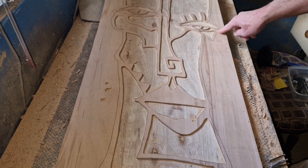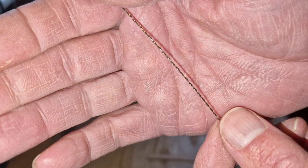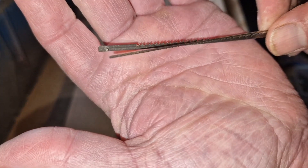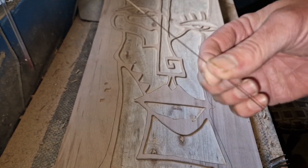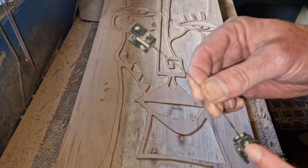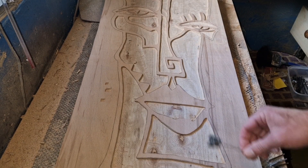To cut this out, you could leave it on that board if you wanted to and put a frame around it. For me, I'm actually going to cut out the shape all the way around — spiral blade on a scroll saw. I've got a Pegasus No. 5 in here. The good thing about spiral blades is the teeth run the full length of the blade, so it will cut in any direction with no turning of your wood. With standard blades there are pin blades and pinless blades — pin blades come on cheaper saws. My little Draper saw only takes pin blades, so I use these little adapter clamps for the pinless spiral blades.